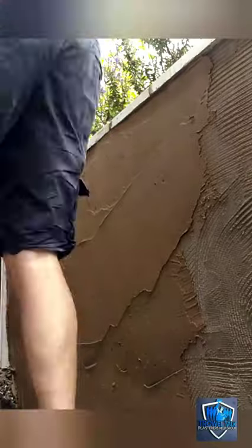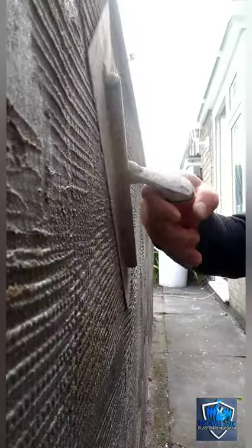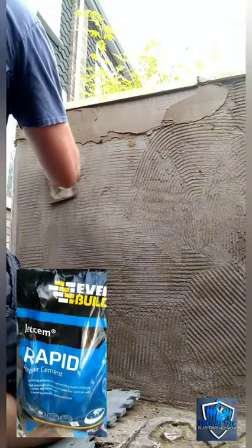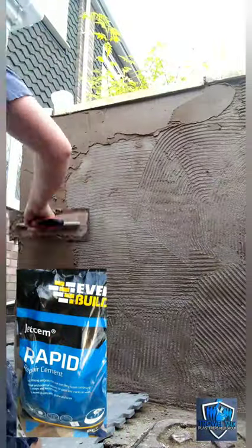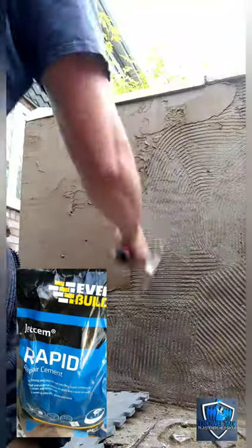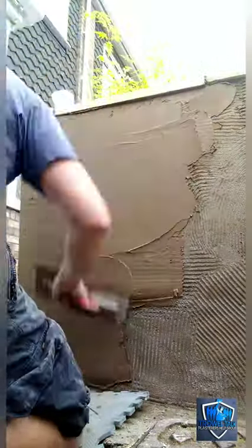So the ticket for an early finish on small cement render jobs — garden walls, garages, stuff like that — on a cloudy overcast day the render can literally sit around all day. What we do is chuck some rapid set cement in there. We've talked about this on previous videos — you can pick it up from Selco's for about six or seven pounds. We chuck two bags of this stuff into a full drum of sand and cement render.